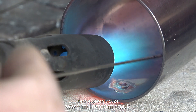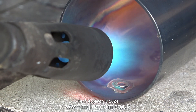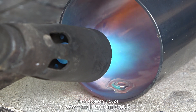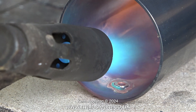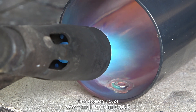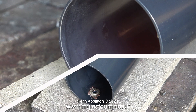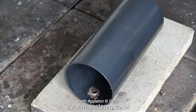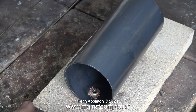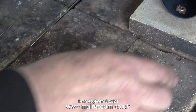I'm just trying to illustrate how to do it. You can't see this clip very well because I can't get the camera too close to the flame — in this area it is extremely hot. I applied the solder too early again. I should really wait until the flux takes on a watery appearance, and then just touch the stick of solder on the joint. Unlike silver soldering small pieces of pipe, do not put the boiler barrel into cold water. I will eventually quench the part in water, but not yet.